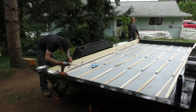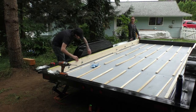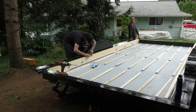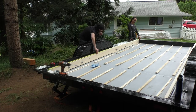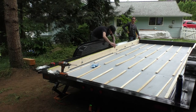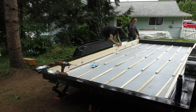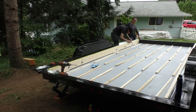We then laid out where the floor joists would go — and this is where we made our first mistake. Instead of following our design and placing the joists according to where the plywood would sit over them, we simply went with 16-inch spacing from the back of the trailer to the front. While that worked for the insulation fitting nicely, it didn't account for how the plywood subfloor sheathing would sit. Tongue and groove plywood is slightly smaller than 4 feet wide, so you need to adjust your joist spacing accordingly. Also, our first sheet was going to sit partially on top of the trailer frame, meaning our first joist needed to be closer to compensate. This mistake meant we needed to cut our plywood sheathing in irregular spots. Take your time doing things right, because you'll end up wasting your time fixing it later.